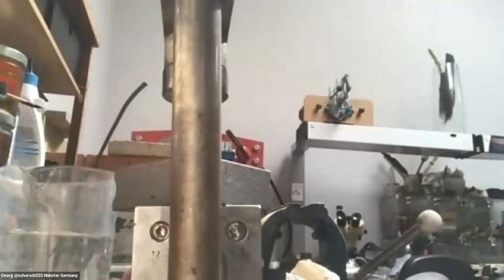So George, while you're fitting with the broach there, there are of course other techniques. You can burn in the blade. People get very worried about burning in a blade. It's not as difficult as it sounds. I can quickly show you how to do that. Just a moment. And of course you can chain drill, so you've got your central hole that you've taken right from the beginning, and you can chain drill above and below that and angle them into your original drill hole to make a more oval and more elongated slot as well.